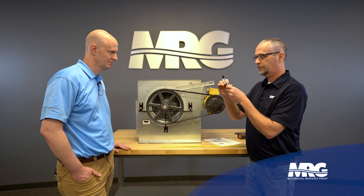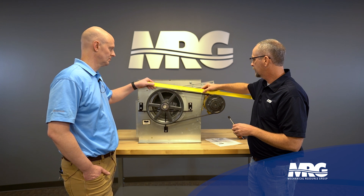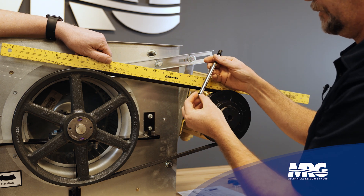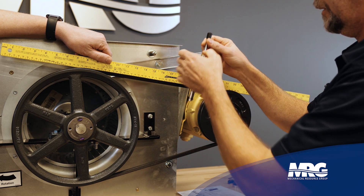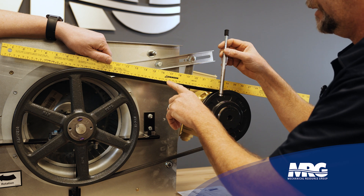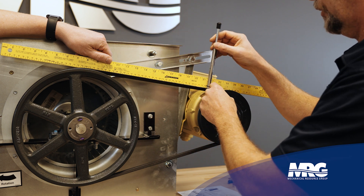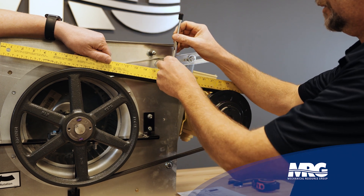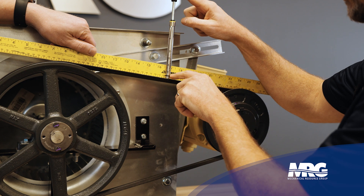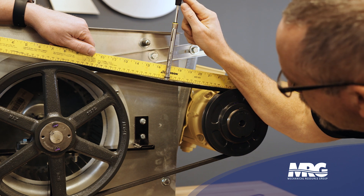The second O-ring on the top needs to be seated all the way down. Now we need a straight edge — set it up there where it's riding on top of the belt. After we've made our measurements and set where we need to be, we've run this top O-ring all the way to the bottom and we know we're right about 17 inches. We need to take our reading from about the center point between these two pulleys on this belt — somewhere roughly right in there. You don't want to be close to either end; it needs to be right about in the center of the two pulleys to get proper deflection. As we push down, this O-ring will go up and stay. We push it down until this O-ring is even with the bottom of that straight edge — you kind of have to get down and eyeball it.